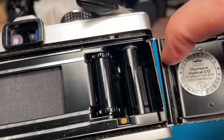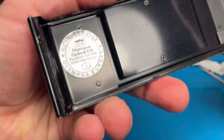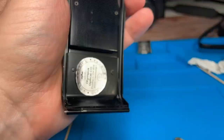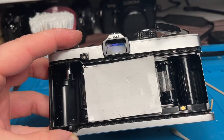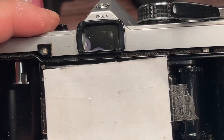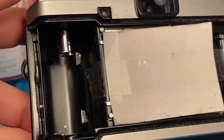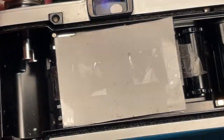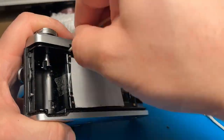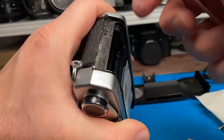Now I start with removing the back door and cleaning it. The process is the same as before — get some cotton sticks and some isopropanol and then clean, rub and get it off. Before I start working on the film chamber, I put a paper sheet above the shutter to prevent any of these little light seal parts from falling into the shutter. If you get some of this inside the shutter mechanism, you will definitely get some problems. Then I use a toothpick and a very fine cotton stick to scratch everything out and with isopropanol remove the more resistant pieces.